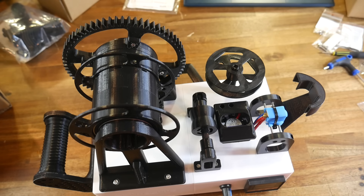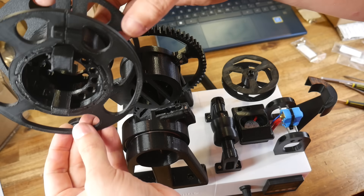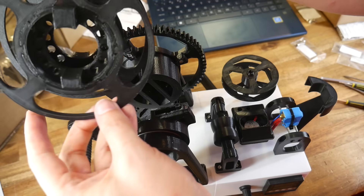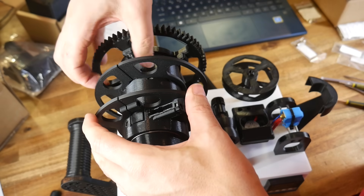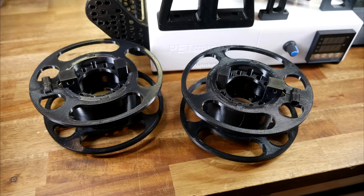The other option is the default filament spool, which remains fixed to the machine. But there is a better version you can assemble with removable spools. These slot in and then have a locking bolt held in place with a magnet. This makes them plenty secure, and of course we can then print multiple spools for easy filament handling.